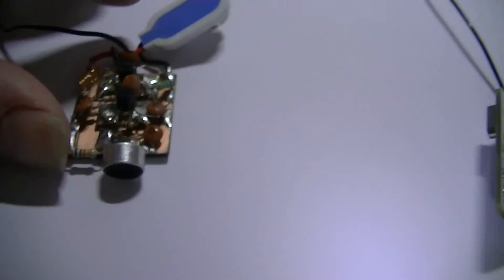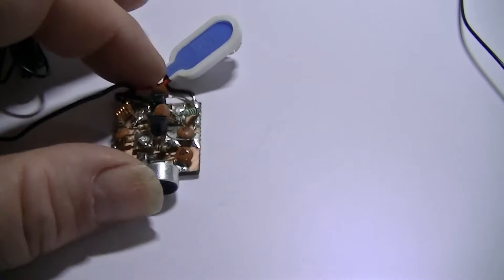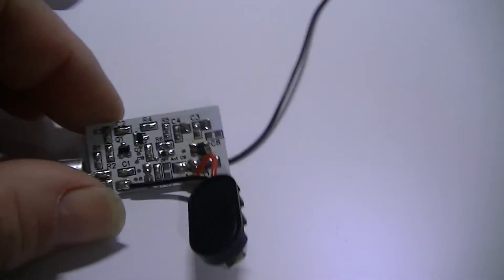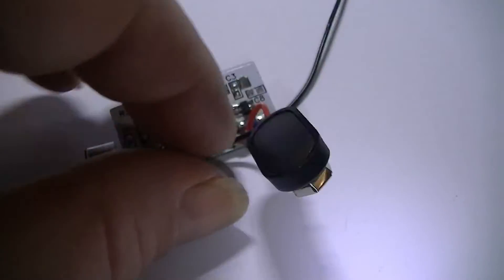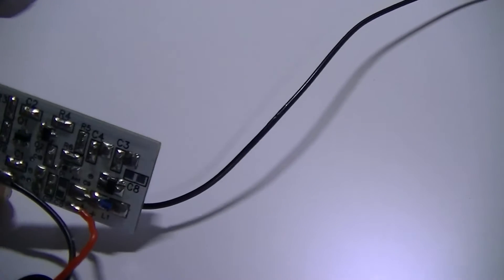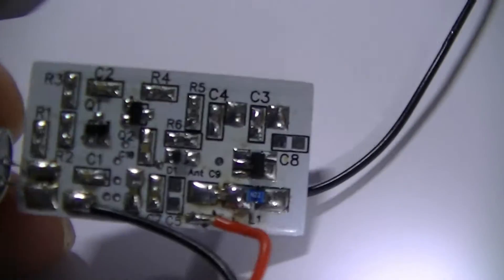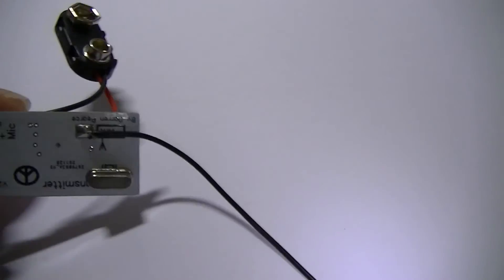In the past I've built these — these are low power FM transmitters. They work from about 90MHz to 110MHz but these are very unstable. I'll show you that in a minute with the frequency analyzer. These are a bit more professional. I used to sell thousands of these all over the world. I'm going to stop selling them soon — I haven't got time, work commitments, I'm working 6 days a week. This is built on the MAX1472 IC, it's a phase-locked loop 6-pin IC. You can just see it there. These are very stable, very good actually. Sold these all over the world, mainly in America.